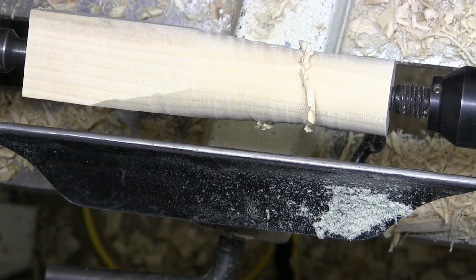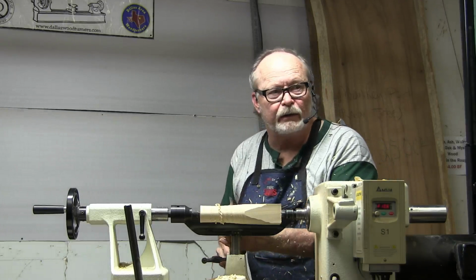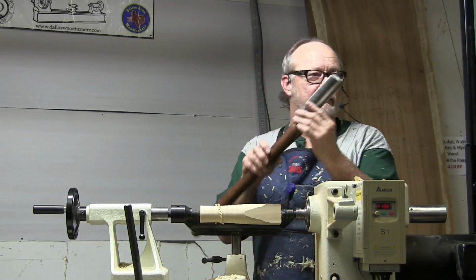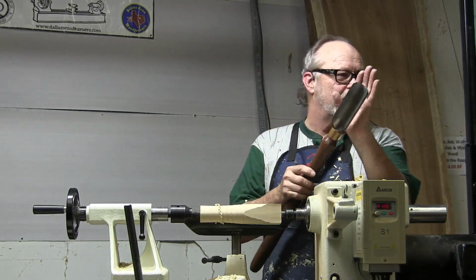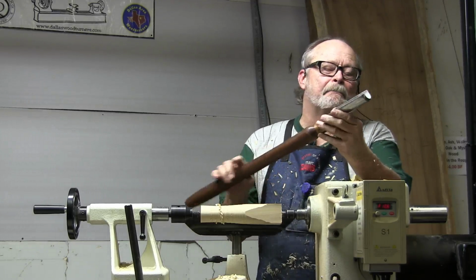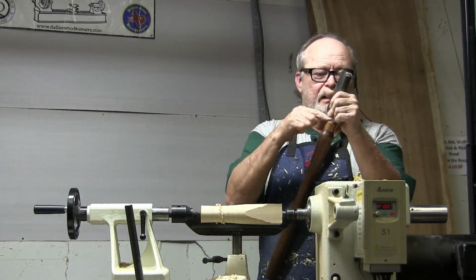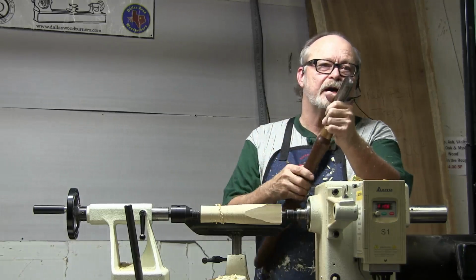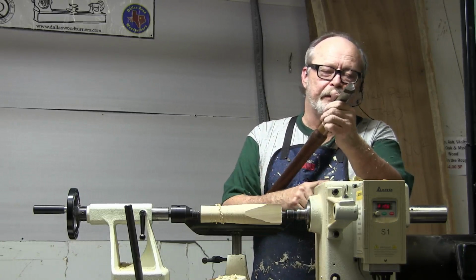And if I did the same moves with my roughing gouge, you know what it would do? It'd just keep going. It's very hard to get a run back or a dig in with one of these. This tool I start everybody on. Usually it's new to woodturning, even little kids or adults. Not a bowl turning tool. You'll break them right here. Don't anybody kid you about that. I carry one around with me that's sheared off. Somebody snapped it in bowl turning. They're not for bowl turning.